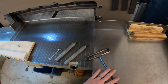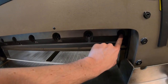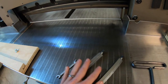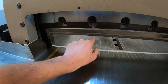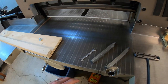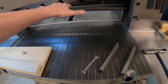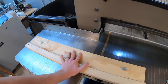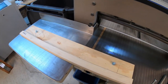What you're going to need to do this is the Allen wrench to take out each one of these, and these two handles that are going to go in the two spots where the groove goes out the whole way, so you can safely take the knife out. And a 9/16th wrench to make the adjustment on the knife depth and the knife carrier, so you can take that to your local straight knife sharpening shop.